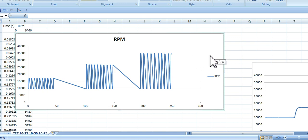And so ultimately what we decided on was 2 tests, because I didn't want to totally focus on the low ends and say, okay, maybe that biases the results to some degree. What we ended up with is a jump from 10 to 30% and a jump from 10 to 60% throttle. We cut out anything where you started at like 50% and bumped up, because it didn't add any data, it just added more runs. The other thing we did to make the data super consistent is that when Carl Pablo wrote up the script, he repeated these runs 100 times per motor. So bumping up 10 to 30% over and over 100 times to get really consistent data, and then 10 to 60%. And I believe what he finally settled on was 100 runs total.